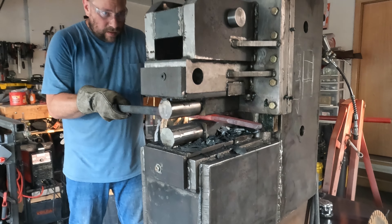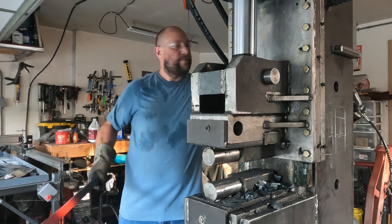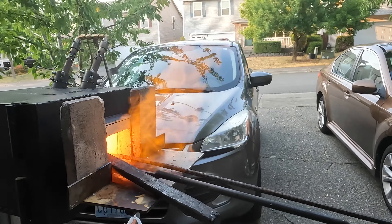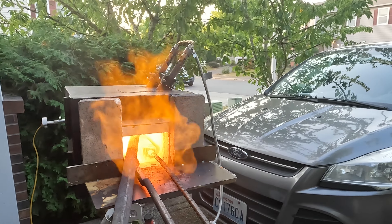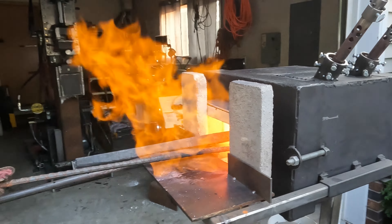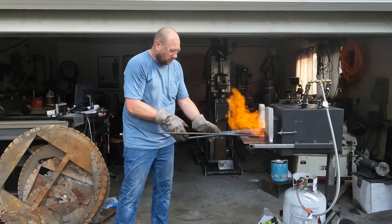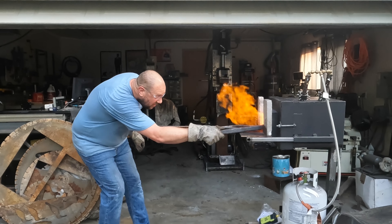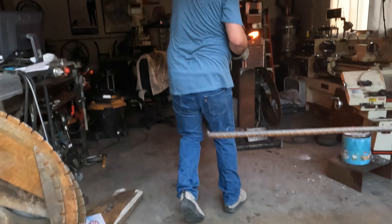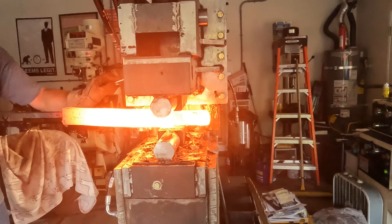You can see I've got a couple of dies here — a set of square dies I call combo dies. They slide in and out, held by just one screw, so I can change them very quickly. I have squaring dies and rounding dies to produce different shapes. The round dies really concentrate the pressure and elongate the steel, while the flattening dies are more even pressure. And I really want to thank my wife for doing all these shots — it's quite a juggling act to follow someone carrying glowing chunks of steel without getting stabbed or burned.